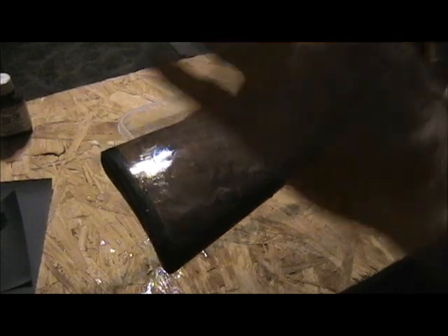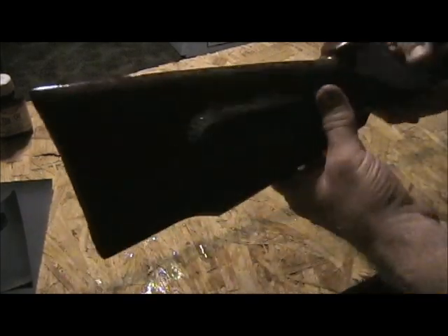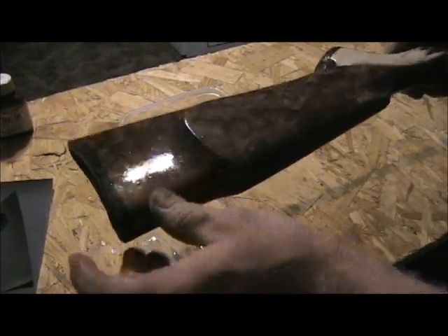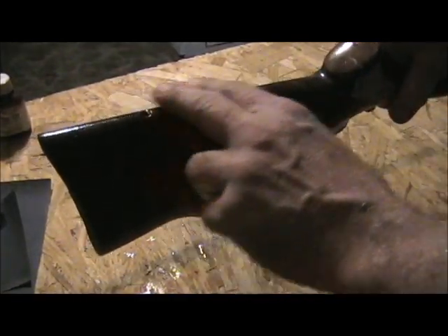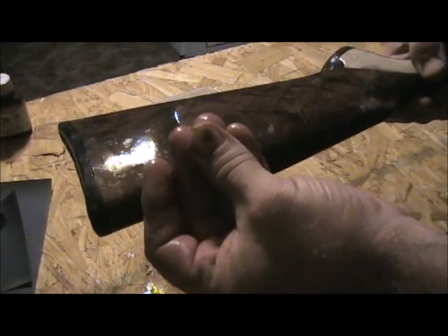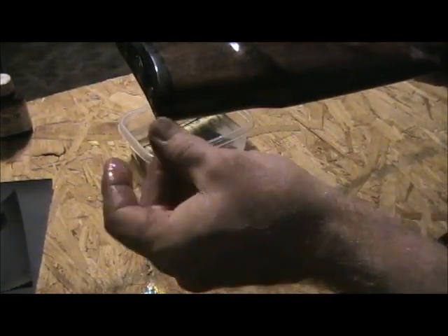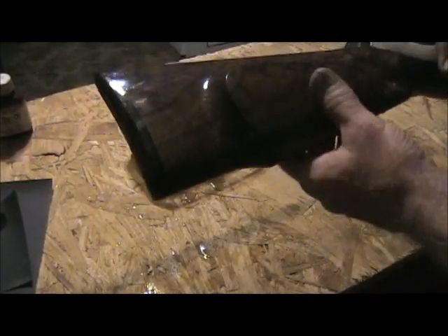I'm going to stop the video and go over the whole stock. One thing I forgot to mention: before you take this step of sanding, make sure the finish is completely bone-dry — you don't want any tackiness or stickiness. It's got to be bone-dry and hard to be effective, because if it's not truly dry and cured it's going to roll up on you and gum up your paper. You want a nice dusty residue from the sanding — if the finish rolls off and gums up your sandpaper it'll take it down too far and you'll be right back into the bare wood and have to start over.